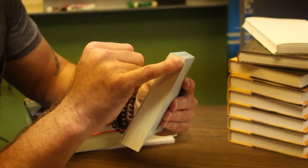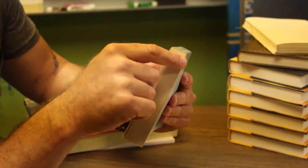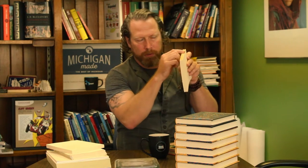So often when people are talking about books, they're starting off with a perfect bound, a soft cover book. You can tell a perfect bound whenever you see a manufacturer — they often go like this to see what kind of bind. Perfect bind is a nice clean edge; it's a full grind with adhesion of glue and the cover to that grind. It looks nice and clean, 90 degree angle. You can see that in this example — it's a nice clean edge with glue adhesion cover on top of it.